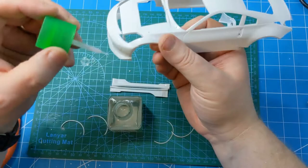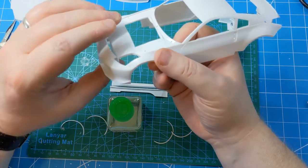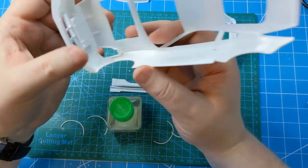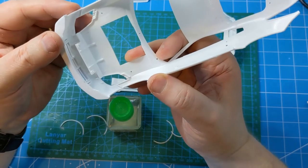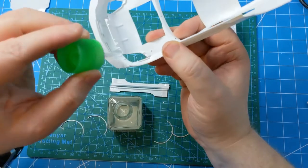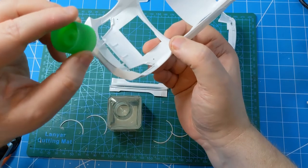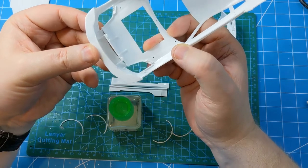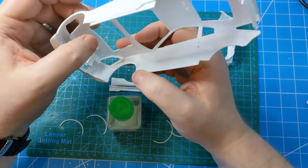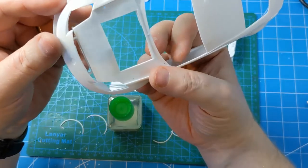This does come with a consequence of adding some extra work. Ideally you wouldn't want to use extra thin on the external faces, but in this case it was necessary to get a really good, strong join on those parts. There are really only two small attachments in the middle and then about two to five millimetres of plastic on either side on the overhangs — it's quite flexible, so it was worth spending a little extra time to get them nicely glued together.